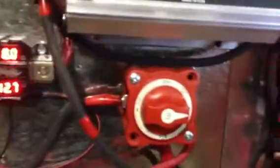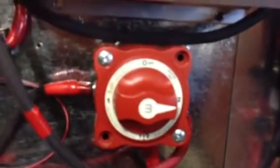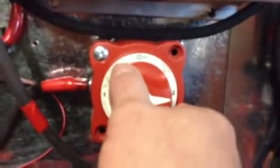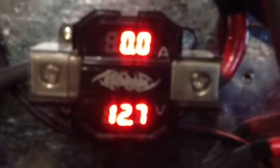I can show you how I have this set up. This is the wind meter — the battery's at 12.7V. I'm going to switch it over. Right now, position two on the switch goes directly to the grid tie. I'm switching it over to the battery that was at 12.7V. We can watch it for a bit — it should start charging the battery up, depending on the wind. The wind's been kind of inconsistent, going up and down.